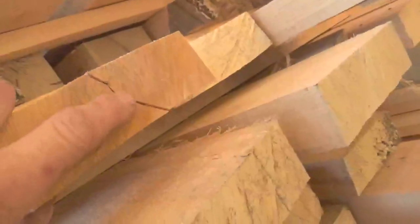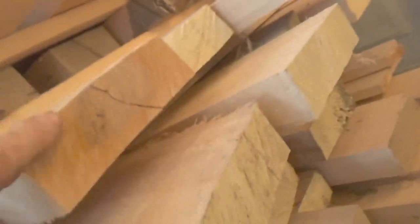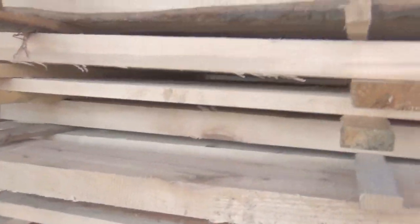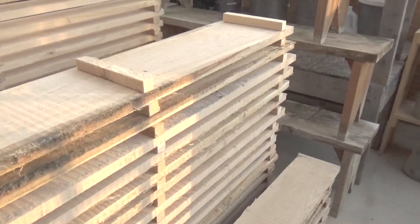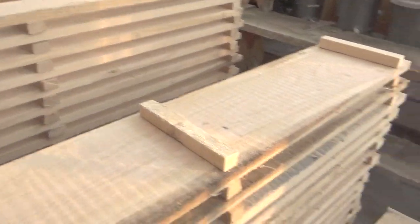This is a check here — a break that's actually from drying. I don't know why that one's not painted; all the rest of them are painted. There are some on the top. This is a maple — I had cut one maple tree down when I was making room for the kiln. That tree, while I was cutting it, was literally bending. I had a 10x10 cant, and the cant was actually bowing so hard it pulled itself off the bed in the middle about an inch or so.